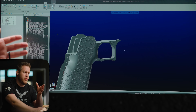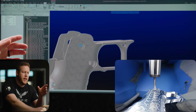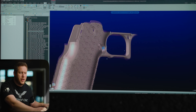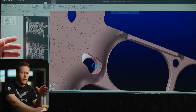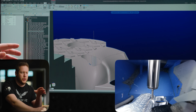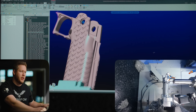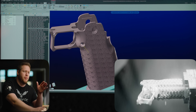After that, I want to start the work on my holes. I'm going to come in with that same tool and helical mill this hole out — there's no sense in drilling it at this point because it's so thin. Then I'm going to step down where the mag release pin goes. I'm not going to helical bore all the way down yet; I'm going to drill that out to get the bulk of that material out. But I do need a flat for my drill to start, so I'm going to helical bore a flat, then come in on the other side and do the same thing. Then I'll be able to come in with a drill — utilizing that same drill from Op 1 to pre-drill these holes.